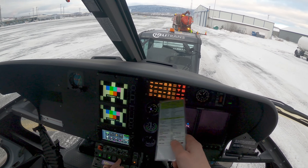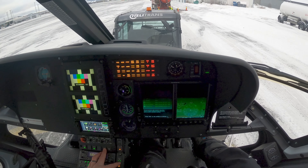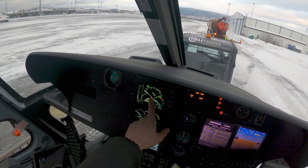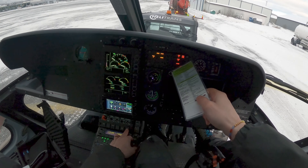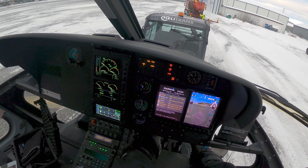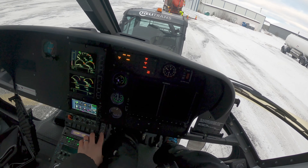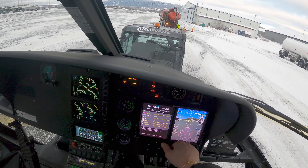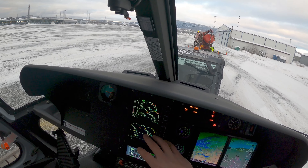Now for the warning lights check — check all of them. Got the lights here, and if you have the floats, make sure one and two light up. Then give it another go — one thousand, two thousand — that's good. Fire test gives the indication right there, got four plus four, that's perfect. Accumulator test and freedom of travel — that's good.